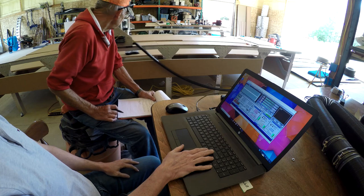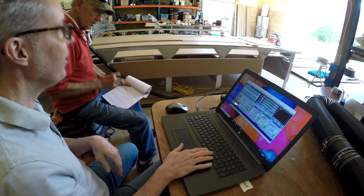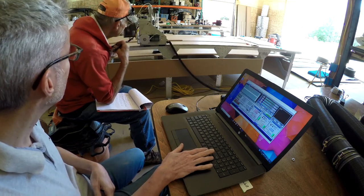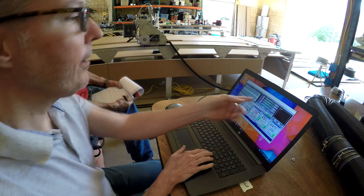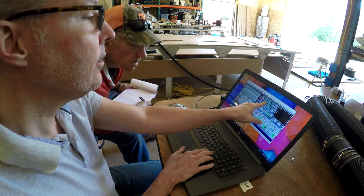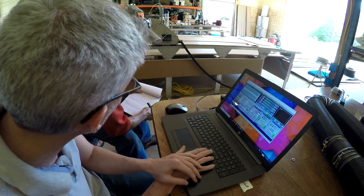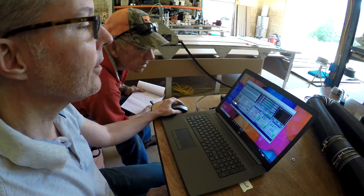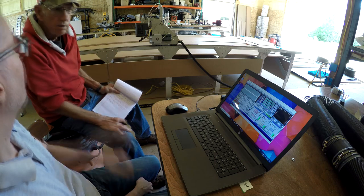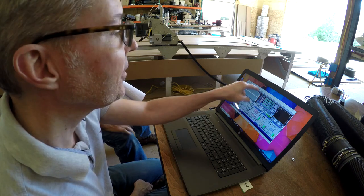We'll start around here. I'm going to set this as my X zero. Now when I move the X, you'll start to see this number move. I'm in the negative region — 12 inches — and I'm sure it's not really 12 inches. Moving to the right will be the positive region. I pressed zero X, and it recorded this as where it thinks the zero position is. So later on when we get going, you'll put it where you want it and press zero X, zero Y, and zero Z. Once the limit switches are set, you can press ref all home and it will automatically go to a position expected to be zero. Or you can just do it manually — I always do it manually because I'm always going to a different place on the table.